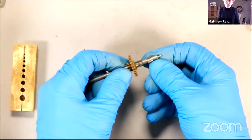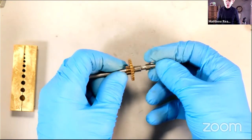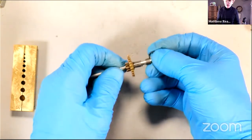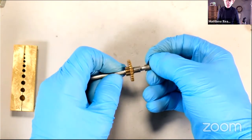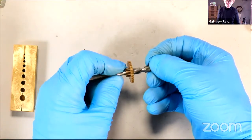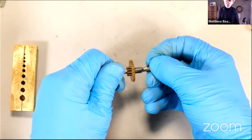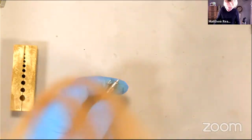Once the camera decides to focus, thank you. And you can see there the safety action working. So the spring in compression goes over the end there, locks in place. But when it's moving in the other direction, say for instance, you set the hands backwards, it'll just ride over the top like that. So clever, very clever little system. Right. I haven't lost it.